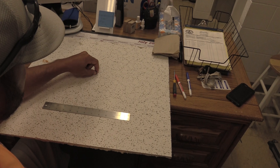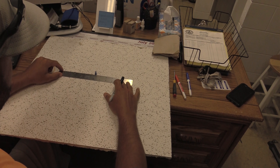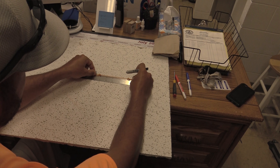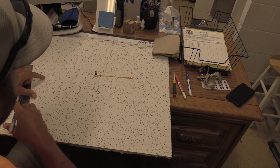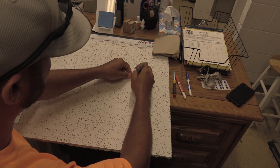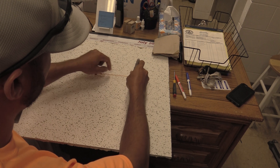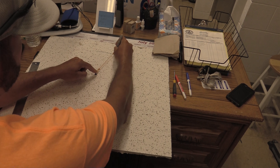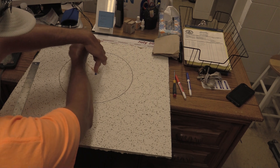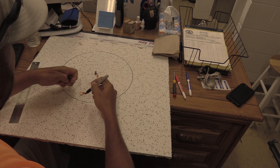First I had to use my measuring wheel and find the center of the outfield, which is pretty easy. Once I found that, I put a stake in it. I knew that I wanted my circle to be 120 feet, so my radius had to be 60 feet. So I got 60 feet of string and put it around the nail. Then I got an upside-down marking paint — blue — and I did the circumference with the string. And that was the circle.